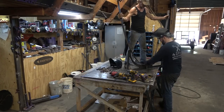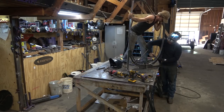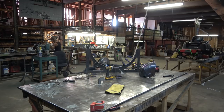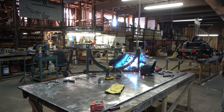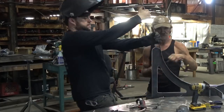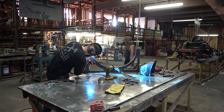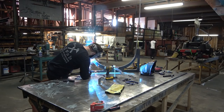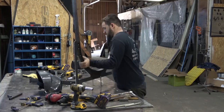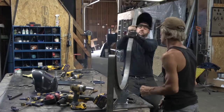Hot damn, that worked a lot better. Just like with the first piece, we're going to be using a liberal application of clamping force to make the two-inch strapping match the curve. But with that big center arch set by the center clamp, this was much easier. It's also easier to do the small radiuses at the end, probably just because we were using a smaller piece of metal — less to have to wrestle into place.